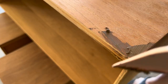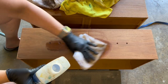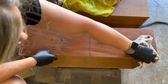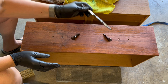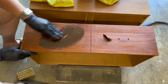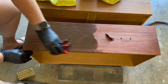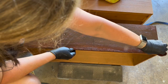Here's the Minwax colored wood filler I mentioned earlier — you can see how much smoother it goes on. I really like it a lot better than the plastic wood. I'm trying a new technique today that I read about: putting a slip coat of mineral spirits down before you put on your oil-based stain. I usually use shellac or a sanding sealer underneath my stains to help it be less splotchy, but I've been having some problems with that lately, so I thought I'd try this technique. Right after you put on the mineral spirits, you apply your gel stain. Gel stain is not a penetrating stain — it just sits on top. The mineral spirits is supposed to help it go on a little more smoothly. You rub it against the grain, then go with the grain, then take a separate rag and wipe off any excess.